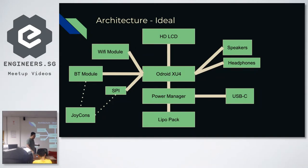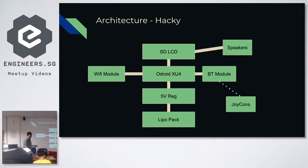The important point is that the Joy-Cons actually communicate over two channels: Bluetooth and SPI. When you dock them into the Switch it communicates over SPI because it's faster — a wired connection operating at one megabit per second. But for this quick hack, I simply used the Bluetooth module and connected them to the Joy-Cons directly.